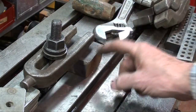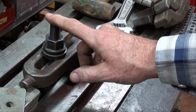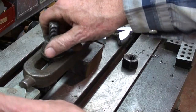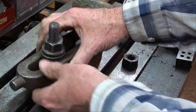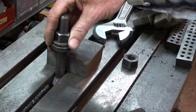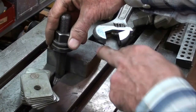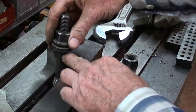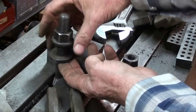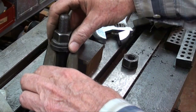When you use these, let this represent the work that we are holding down. You need a T-bolt and then you need some kind of packing on this end that is approximately the same height as the work. Be sure and place the bolt closer to the work when you do this packing — otherwise you get more pressure on the packing than on the work. Be sure and use a heavy, thick washer in there, not just a common wrought washer like you might use on a tractor.